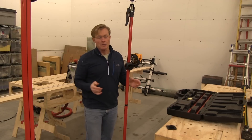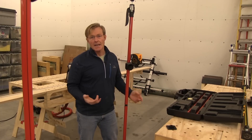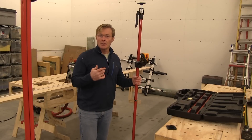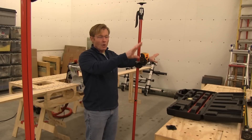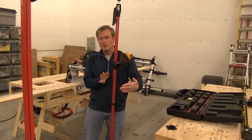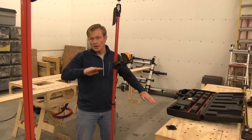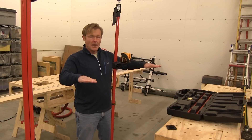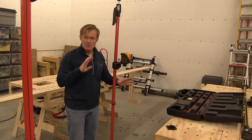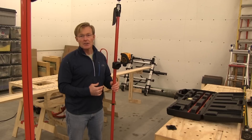There are a lot of great uses for a laser — it has been a staple in construction for a long time. I can't imagine doing finish work, particularly setting cabinets, without a laser. It's a must. With this setup I can move it around the room. On the job I just finished, I had a bank of cabinets on the wall and an island. I was able to just move this around, turn it, and reset it on the bases I'd already set — rolling the laser toward the island to get it level front to back and ensure the countertops would be exactly the same height.